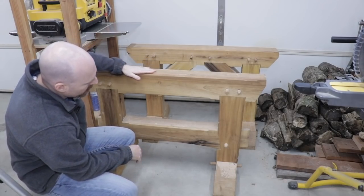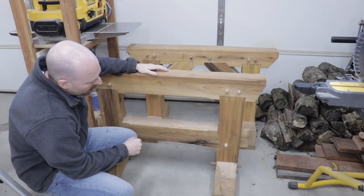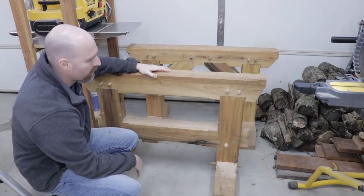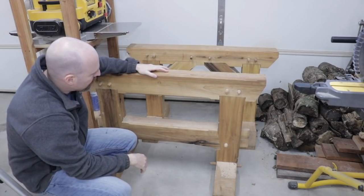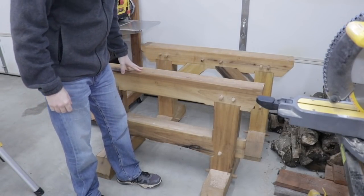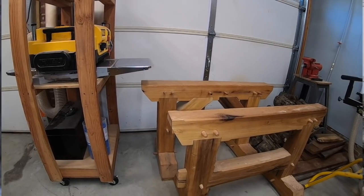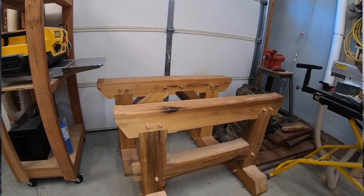These are built out of mostly four by six material, some five by six, and they're all mortised and tenoned together and drawbored together and have no glue or nails or screws in them. The sawhorses were originally very heavy because I built them out of green timbers, but now they're actually quite light. The sawhorses are actually built with two different designs — one having a horizontal member and the one in the rear having two wind braces.